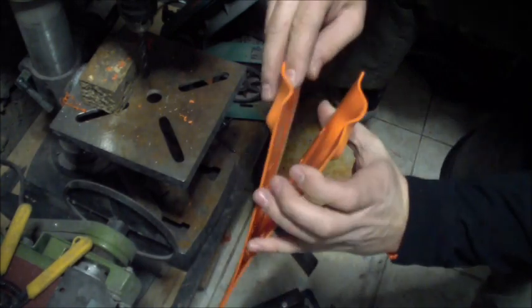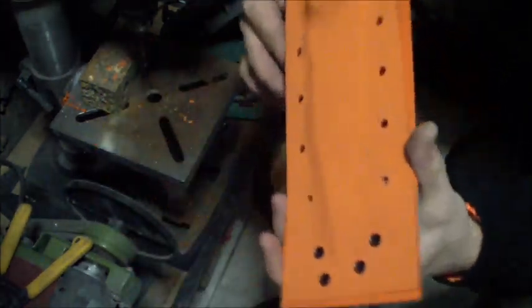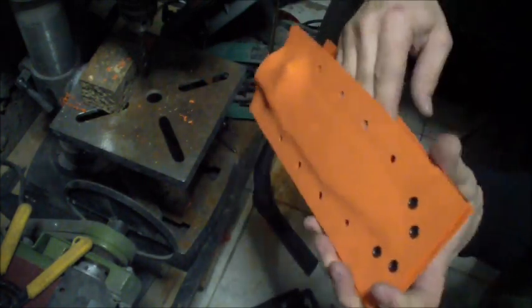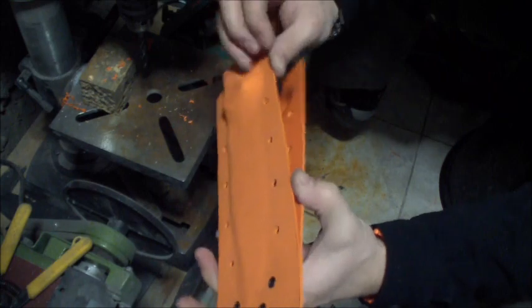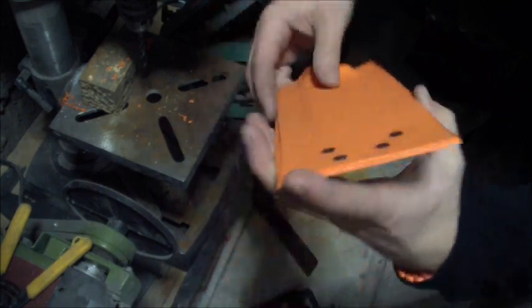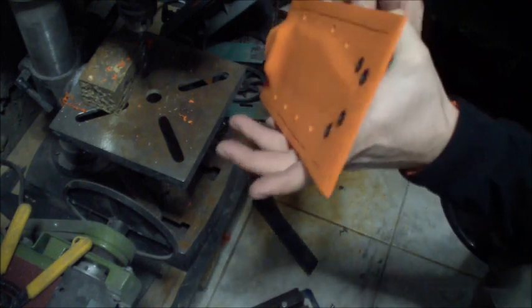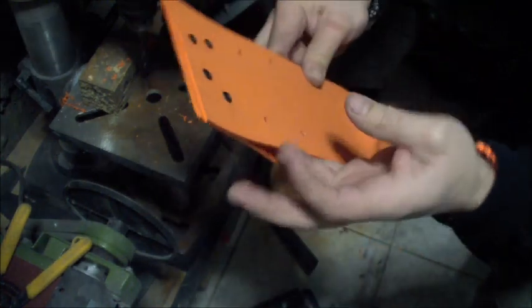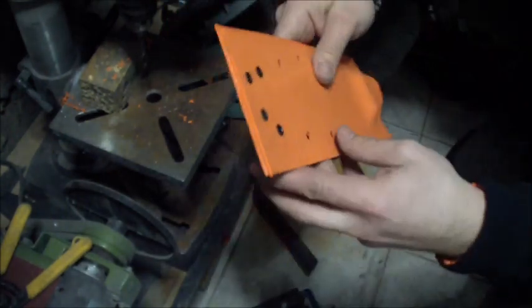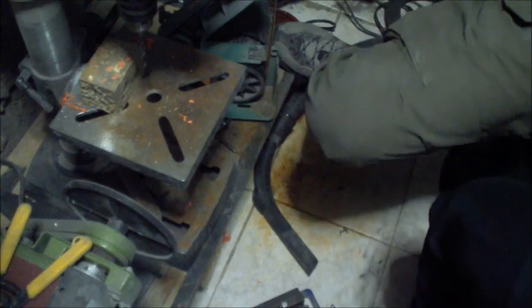Again, I'm gonna just open it without breaking that bottom rivets. Just clean it from those burrs, from those pieces of kydex that are inside from drilling, so I don't create any gaps. You can do it with the knife, you can just stick the knife through from the side, clean it like that, get the rest of the rivets.